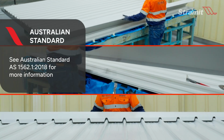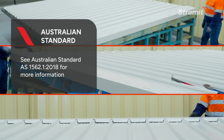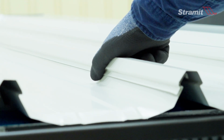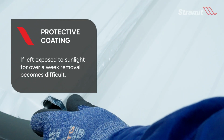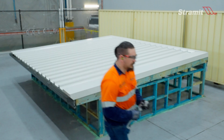Be sure to install all flashing as per the Australian standard for design and installation of sheet roof and wall cladding to ensure complete waterproofing. Clean the roof at the end of each workday by removing screws, cuttings, swarf and debris. Ensure the roof is clean and watertight. Remove the strippable protective coating from sheet ribs. If left exposed to sunlight for over a week, removal becomes difficult.